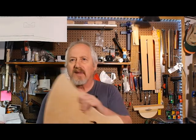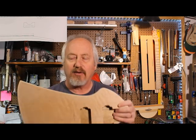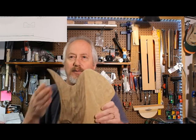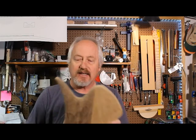All right, just got done creating a lot of sawdust. So what I've got done, got the bodies sanded down to 220, except for the tops. I'm going to leave that until after I finish, that way I don't lose my center line. But I've got the belly carve into this one. I'm going to wait and do the neck heel and the upper fret access once I get the neck installed. But I've got nice round overs on everything, and it's nice and sanded smooth for that one.